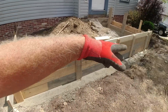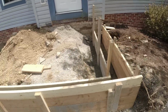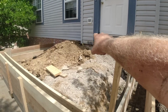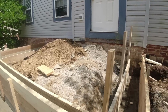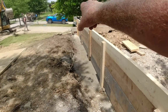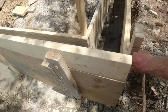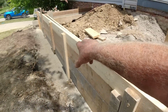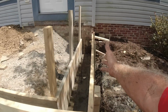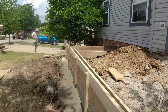So we are pouring the foundation and we'll do our styrofoam inlays. I wanted to get the frame up. This is complete. The front, now we'll cap it with a porch and it'll go right up to just above our old concrete height. Now I didn't want to just look at this raw concrete. I'm gonna lay it out outside to outside. We are 16 feet 2.5 inches. So I'm gonna find center of steps minus that section. We'll do 2 inlays there, 2 on that side, and maybe 1.5 over here because it's 2 feet shorter. I'll get that laid out and talk about that tomorrow morning.